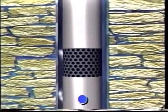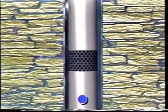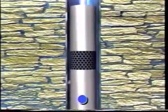To show how a typical water system works, let's follow a drop of water on its journey from the aquifer to the home. Here is the water drop deep underground — it has been moving slowly through the formations for a few years since it first entered the ground as a raindrop. Right now there is very little movement of groundwater in this aquifer. When the tap is turned on, at first water comes from the pressure tank, but as more is used, the pressure switch starts the submersible pump. When the pump switches on, our water drop moves from cracks and fissures in the formation, through the well screen, and into the well.